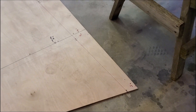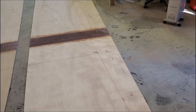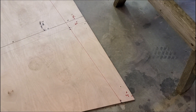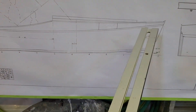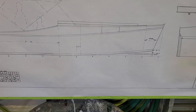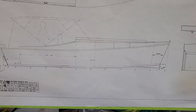One fallacy of laying this out on the inside of the hull — which is really the only logical way to do it, since we need these station and bulkhead marks on the inside for assembly — is that the shear line is also marked on the inside, and that does us no good when it comes to actually installing that piece of trim. This is that shear line. It's just a cosmetic piece — it's a gunwale, a rub rail. Since the hull and the cabin are all one plane and one piece, that shear strake is really going to define the boat's appearance and give it that swoopy shear line.